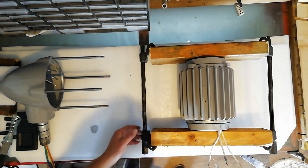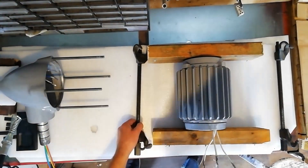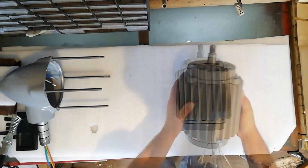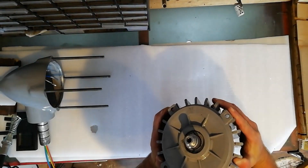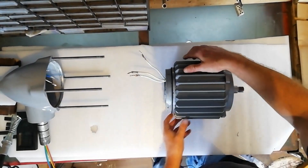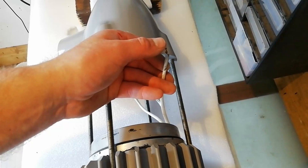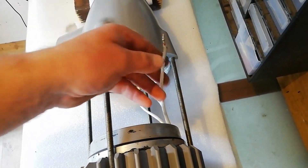It's now time to take the clamps off. All looks good — no unevenness anywhere, no gaps, two plates sitting flush and bearings flush where they should be. We can now introduce this into the turbine body and solder the phases onto the slip ring. To make sure you get a good solder and a solid connection, cut off the original little spade connectors that Istabreeze fit to this, and then pre-solder all your wires so that when it comes to joining them they go together nice and easy.